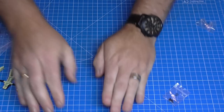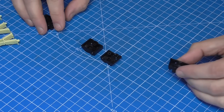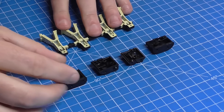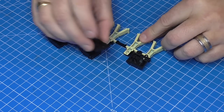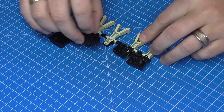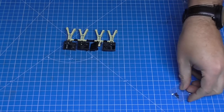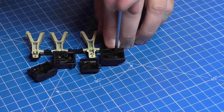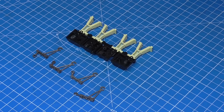Put those to one side and bring over the cylinders — they are labeled: L6, L7, L8, and L5, so the order is eight, seven, six, five. We're going to be putting these onto this metal structure here. It has got a locating lug hole, so they fit in like that. We secure these into place with BM screws. This is going into metal so all of my screws have been put in oil. Make sure they're tight with no wobbling. That's all there is to do in that stage.